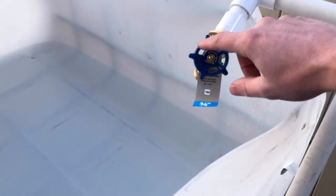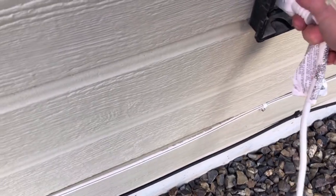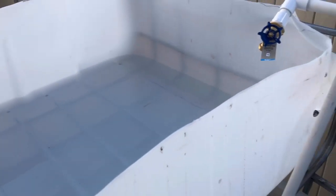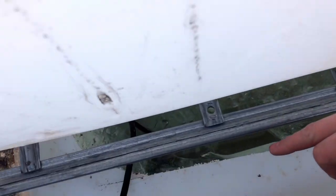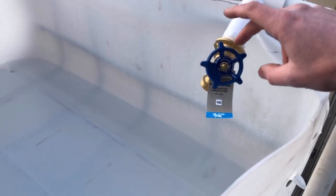Before I used ball valves right here and it's so hard to change the flow on an easy timetable. So with this second build, I've upgraded to this hose bib right there, which screwed into three quarter inch pipe that's running from the pump down there — three quarter inch pipe to a 90, 90, and then a male fitting into this hose bib.